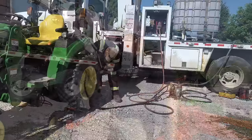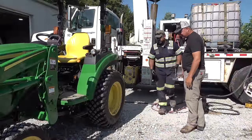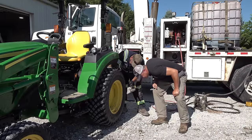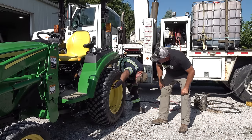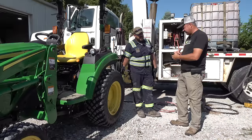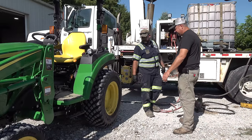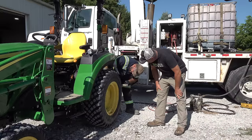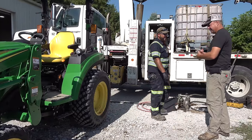I can't hear any difference — he pounds on that tire and it all looks the same to me. If you've got just a loose tote on the bed of your truck without any way of measuring how many gallons you're putting in, you just thump on the side of the tire and you hear how solid it sounds. When you get your way up towards the top, it sounds hollow. And you want it to be just below where the valve's at, so that when you go to check your air pressure, you're not getting any of that fluid inside your gauge or your air chuck and spraying it back on yourself. I could hear it there — I couldn't hear it before. That's why I was thumping on this one; it was a little more difficult to listen to compared to the others.